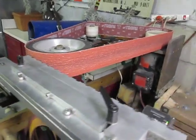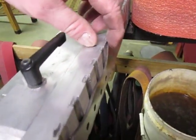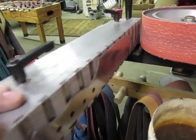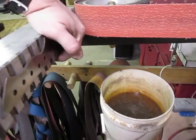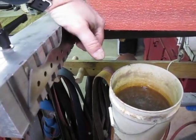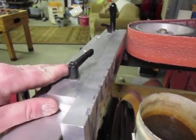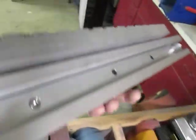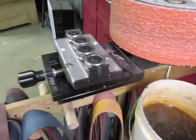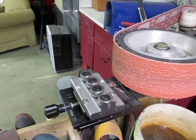The main parts are the mag chuck — this aluminum bar that I've machined slots into, and in those slots go neodymium magnets. They're really strong magnets, so right now it's holding a chef knife on here. It holds your workpiece flat against it. That's mounted to a linear rail, which is really the heart of the whole machine — it's precision machined with hardened rods inside that interface with grooved ball bearings, allowing it to slide back and forth with tight tolerances.